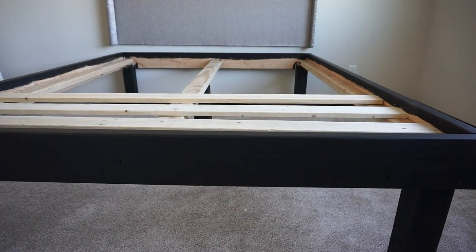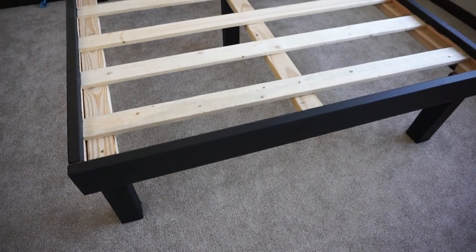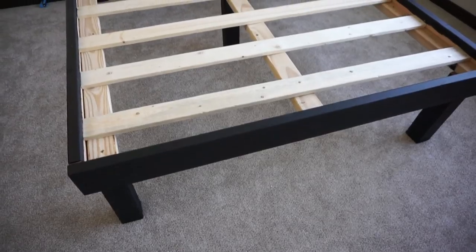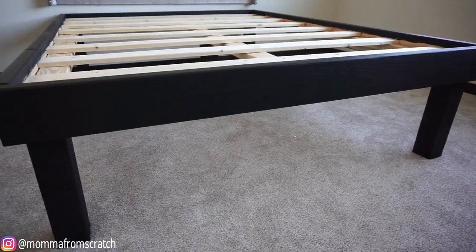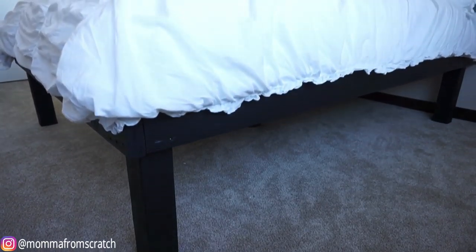The next step is to add your bed support slats. I usually add them anywhere from six to eight inches apart — it's your preference. Then I screw those down on each end including the middle so they don't move. This is how the bed frame came out — I think it looks really nice. You can see how I've painted down about an inch on the inside, and along with the headboard it just looks great. You can add whatever type of mattress you want without a box spring, and I get mine off Amazon — everything will be linked in the description below including all the cuts you need for your wood and the headboard.